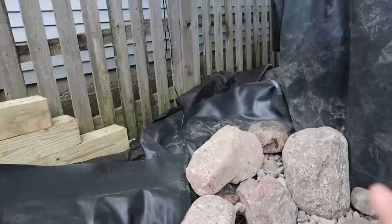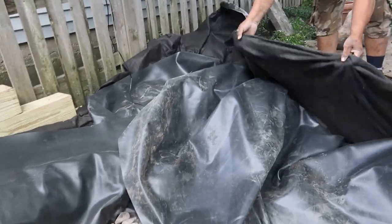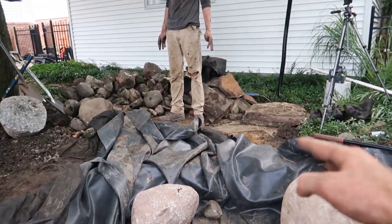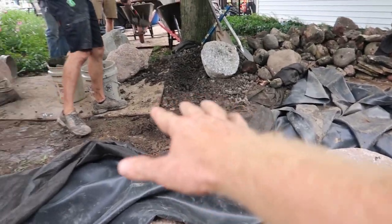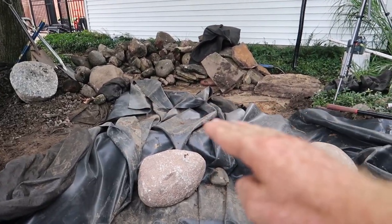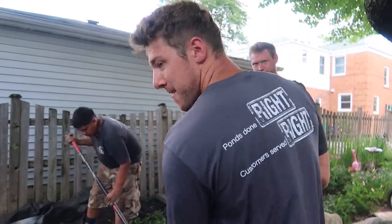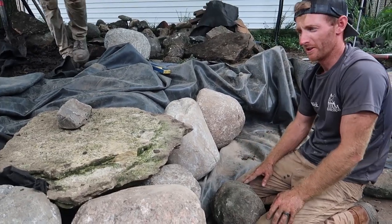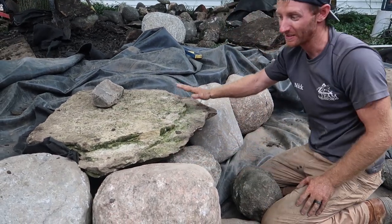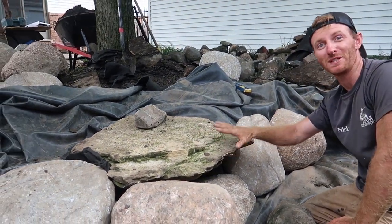We got the skimmer hooked up over here and we are probably 60% of the way done rocking in the pond. They just threw that over the power head — there's a power head right there — and the waterfall is going to go right here. Skimmer and biofalls are both framed out. Now we're going to bring that patio across here. We've got that one cantilevered stone, and it might swoop back that way more so we can bring that patio out over it. Fish cave is also in. This is Trevor's special rock — we're packing some stones underneath it.